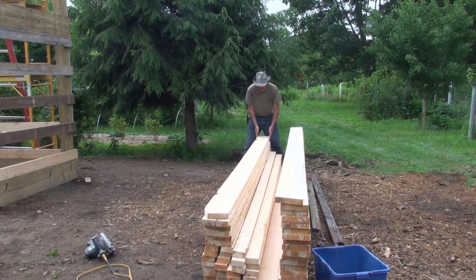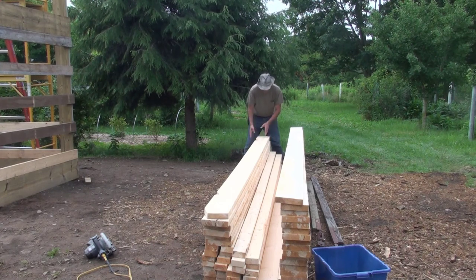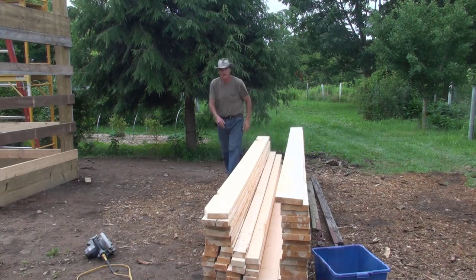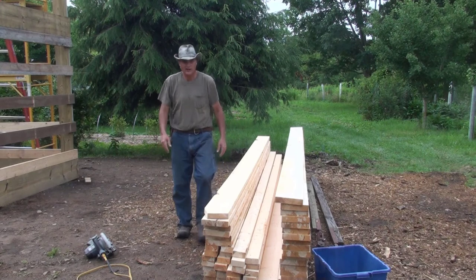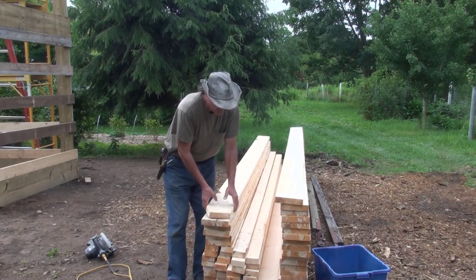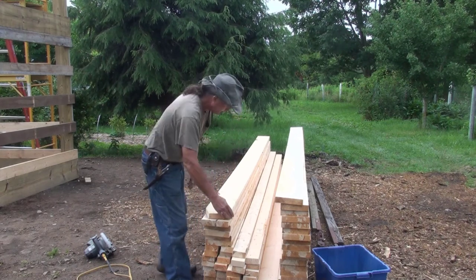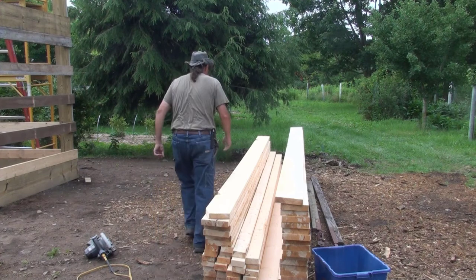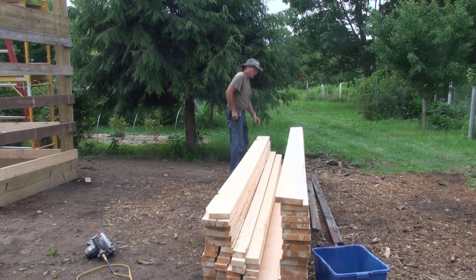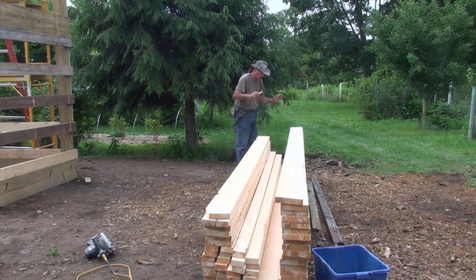Make certain that each side of the pattern and the board that we're marking are smooth, that one isn't above the other. The end is equal. Before I start marking, I come down to the other end. I pick up on the pattern a little bit, set it so that they're both parallel with each other. So it looks good. It looks like it's sitting on it. There's just a slight crown to it, which is just fine.